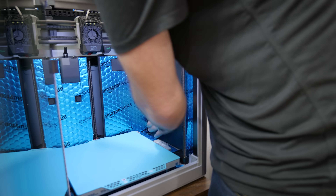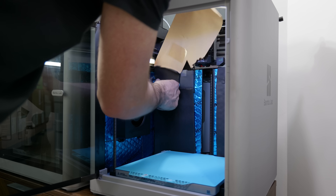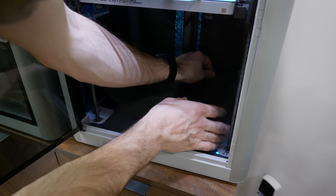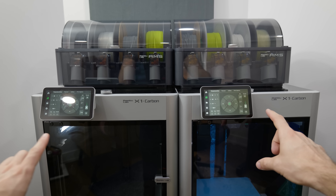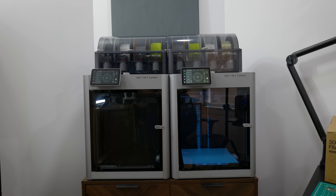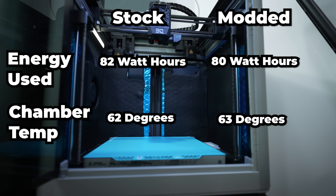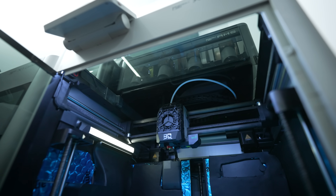The primary reason I added both materials is insulation. Insulating the chamber will hopefully give us a couple of benefits: certain materials print a lot easier in a warm chamber, and it should make the printer and bed heat up faster while consuming less energy. Clearances were pretty tight so I couldn't get it everywhere, but something is better than nothing — or so I thought. Maintaining an 80-degree bed temperature for an hour required pretty much the same amount of energy, and chamber temperatures remained almost identical. There was a slight improvement in sound transmission, but honestly I don't think this mod is worth it. The whole case is just too leaky, and if you really want to see a big improvement you'd need to cover the glass panels and add weather stripping to the front door.